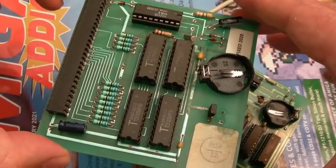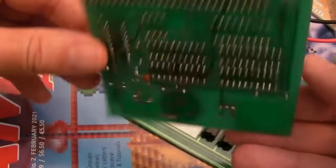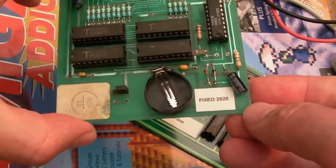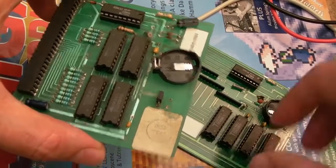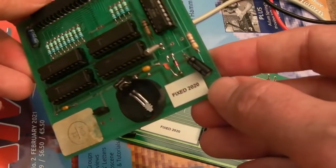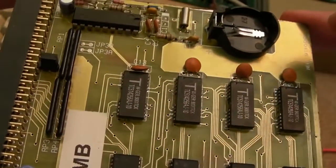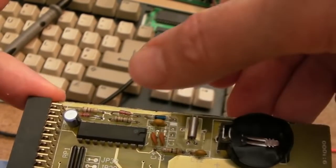Here's another one with the same issue. I fitted sockets on it — there were pads damaged on the top so a capacitor couldn't fit there. I managed to fit the Schottky on this one and probably cut a trace on the top side. You see these jumpers — it's simply to enable or disable, that simple. The contacts and traces were a bit flaky, but it's now dead reliable and rock solid. Fixed in 2020 and used for the last 18 months on, I think, the Rev 6.